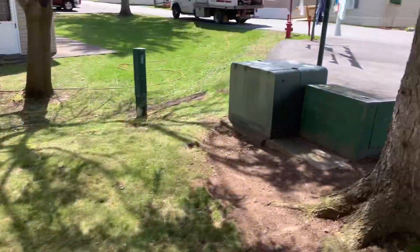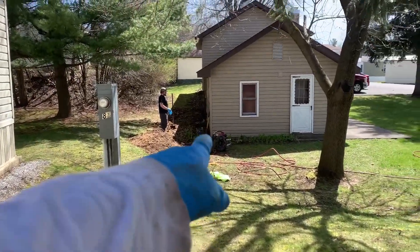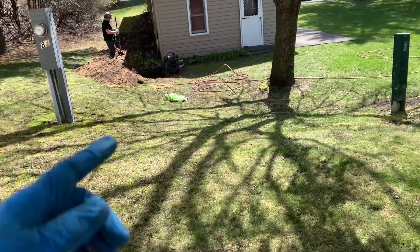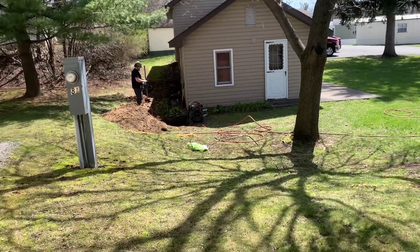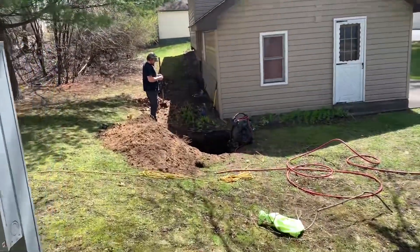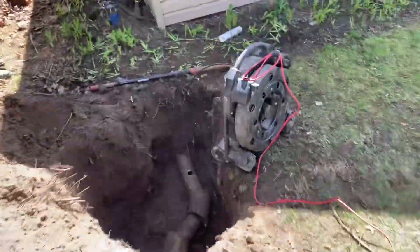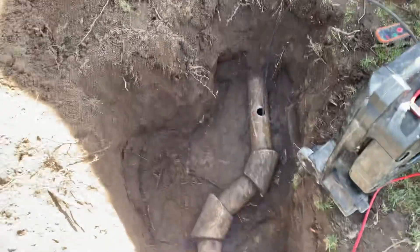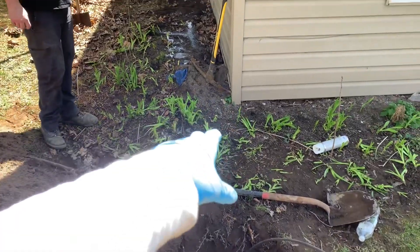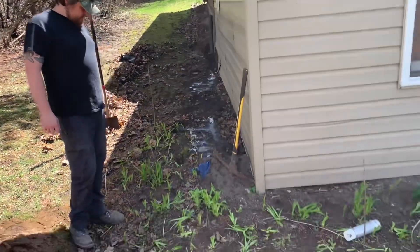From this point it could turn and go that way, who knows. We're going to currently dig up beside the house to get access and go upstream through the broken riser where the clean out is. The tech is at least looking at recommending replacing these joints with some longer sweeps so that we're not having two joints so close together. Longer sweep bi-directional clean out here at the end, and fresh pipe up along the side with new connections.